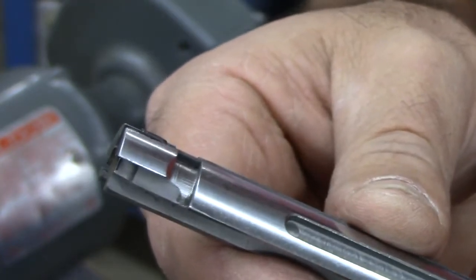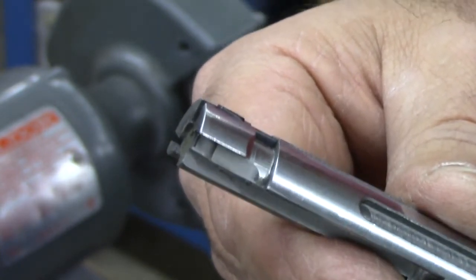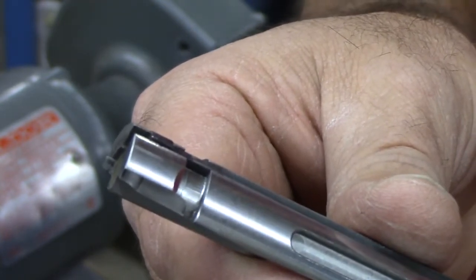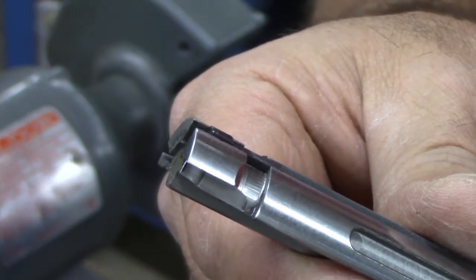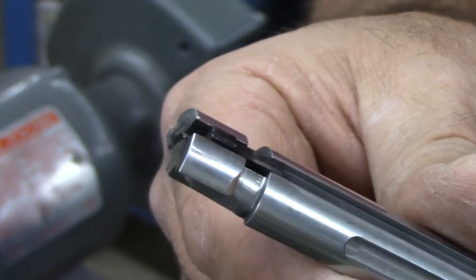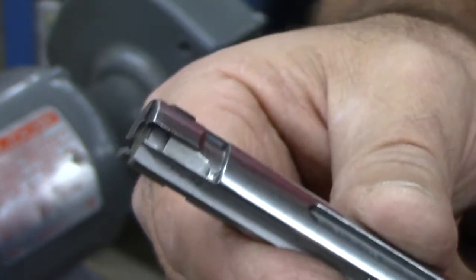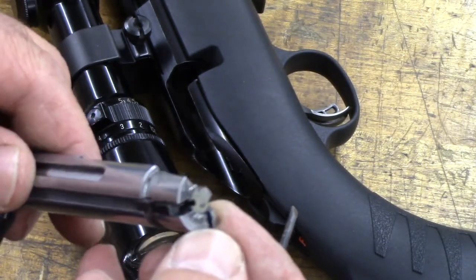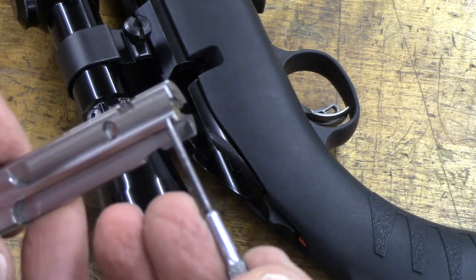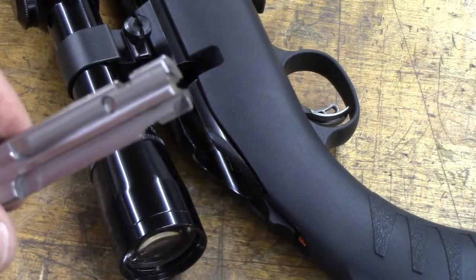It is so easy to overdo things and go from making things run smoother to making things a big mess. A person could say, why don't you just shoot the thing a little bit more and let it all work itself together, burnish itself in — and I'm all for that. However, when you're seeing scratches, not just burnish marks but literally scratches in the surface of your bolt, to me that's not something I want to just allow to work together. I want to get in there and smooth that up. None of these things should affect accuracy other than that bottom of the bolt plowing lead and lube off the tops of the bullets in the magazine.